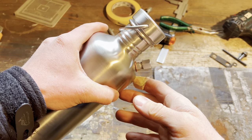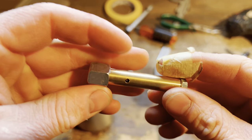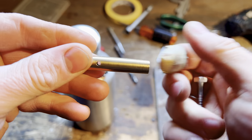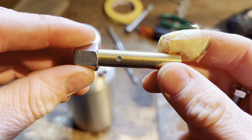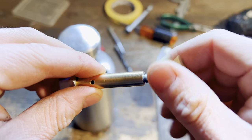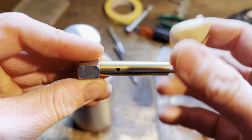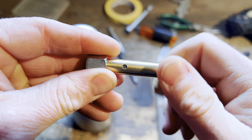So this thing here isn't just a water bottle slash desalinator, it's also a pressure cooker. For that I made this — it's a pressure valve, all stainless steel and brass. The main tube is brass, it's got press-fitted stainless steel inserts on both sides and a stainless steel ball bearing. It works by this spring applying pressure to the ball bearing which seals tight right here, and the pressure adjustments go from zero — you hear it's loose — to about 30 PSI when tightened all the way.